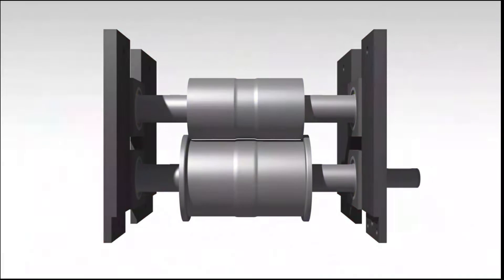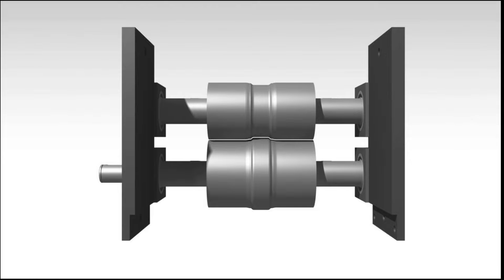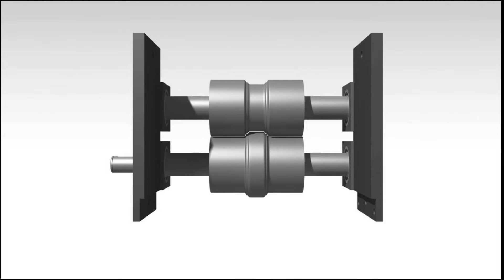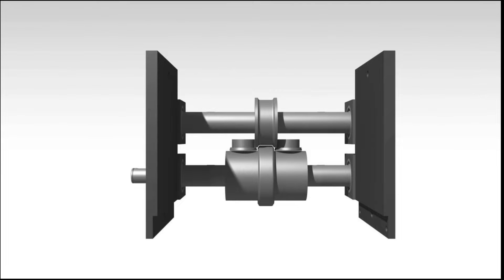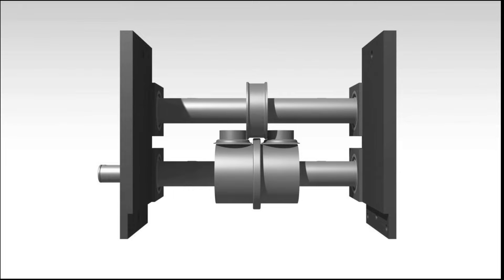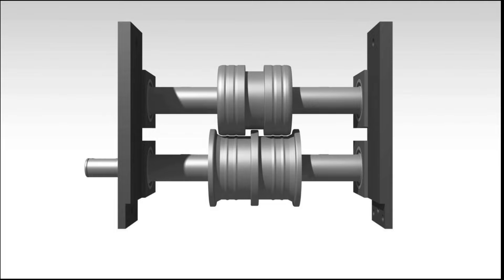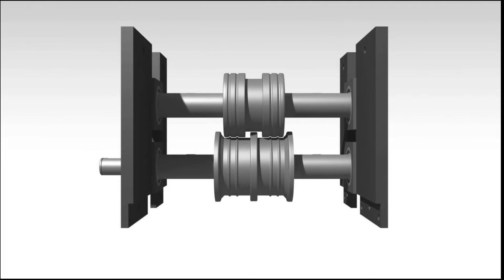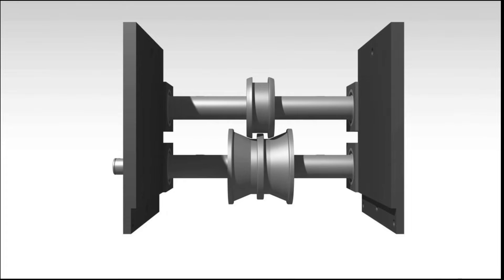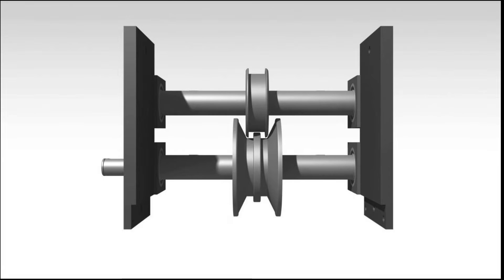This is a really cool 3D simulation — you can see step by step how each different roller is designed and what it does. As you can see in all of the designs, the down roller shaft's middle diameter is the same. This is because once we put the material inside, we want to feed and roll the material at the same speed and the same distance, so it comes out with our final result.